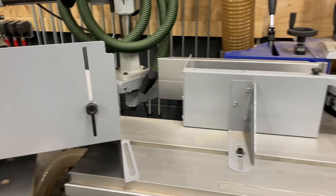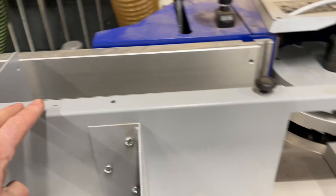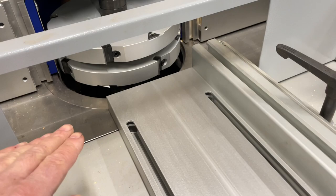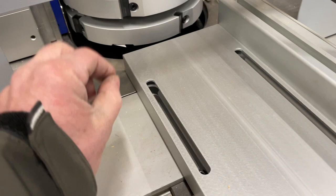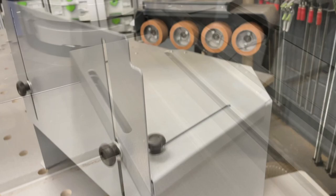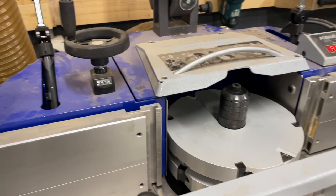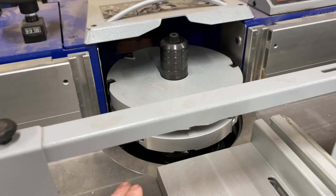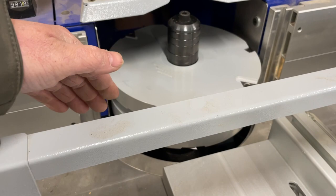Here's the tenoning setup. There's an optional hood and guard, plus a couple of plates that can be rotated in 45-degree increments. This lifts the workpiece above the cast bed for a more accurate, repeatable cut. I found that when clamping to the old F3, any slight movement in the wood catching the cast plate can cause deflections while tenoning — so always use something to lift it off the sliding bed. The proper hood goes on when you lift up the fence system.